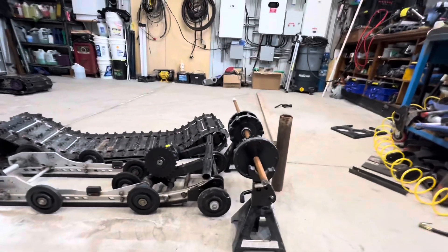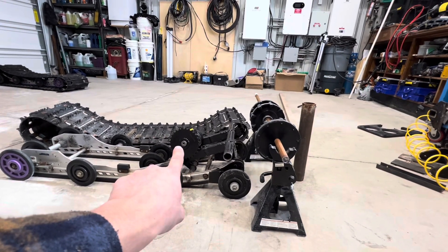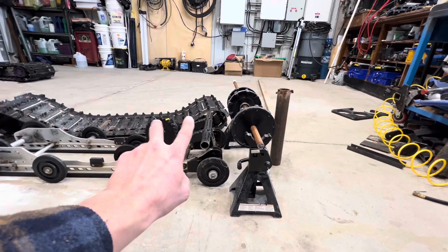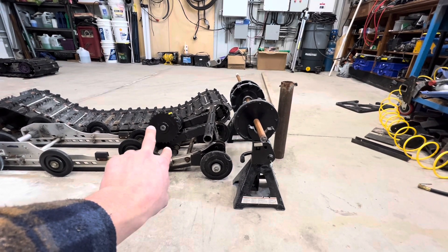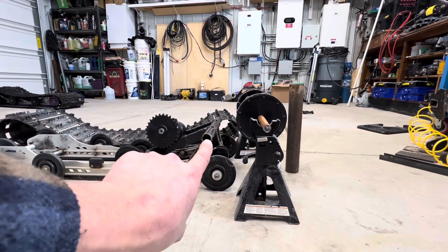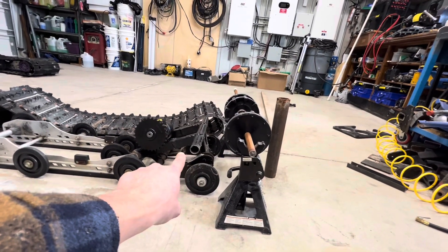I've come up with a little mockup here — excuse the crudeness, but this is going to help you visualize what I'm trying to do. I have the drive motor just sitting in place. We have a laser-cut plate that's going to be used to mount it, in place of this piece of square tubing. We're going to cut it out, weld it in. The motor will mount there. It has some slots for adjustability to tension the chain and get any slack out of it. A key note here is the angle of this tube — as it rises up to this mounting tube, we're going to carry that forward all the way up to the drive axle on the track, which will allow the chain to pass over and under that tube without any interference.